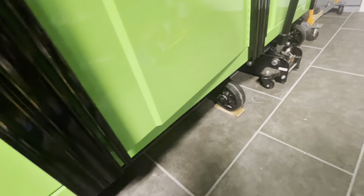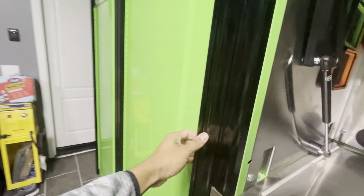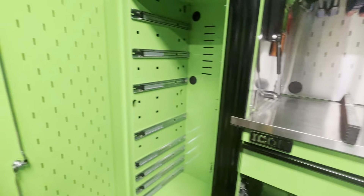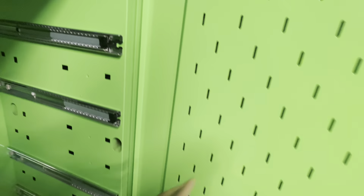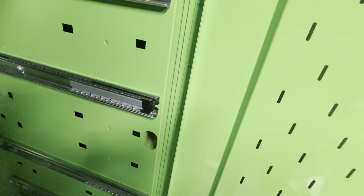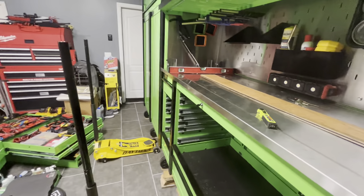This door is slightly sticking — you can see at the bottom. The doors open up that side, and these ones open in the opposite direction. To fix it, you basically tape the hinges off, flip the door upside down, and I'll end up flipping the lock around just to make it align with the numbering on everything else, since that door is now flipped. Same thing with this one. All in all, it's coming together well — just taking a little bit of time.